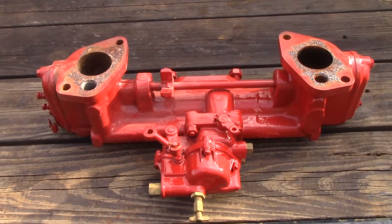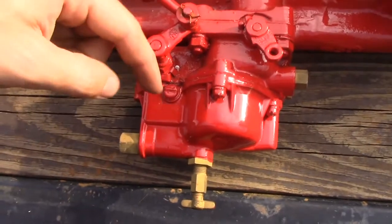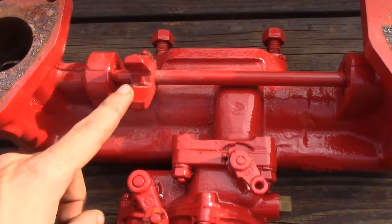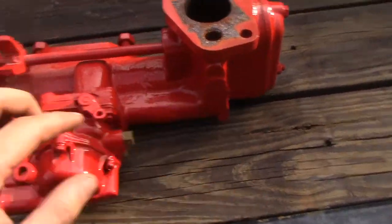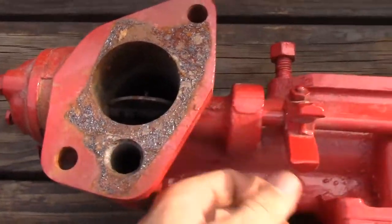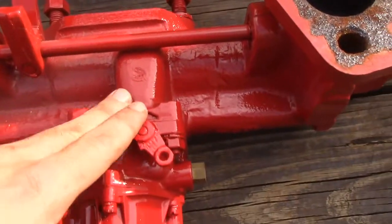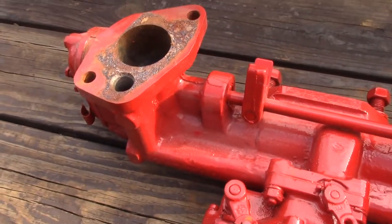Looking at the back side of the intake manifold, you have your little arm here which controls the seat of your needle — the needle seat closes to start and stop the flow of gasoline. You have your choke lever on the back side, and this lever sits in the linkage that goes up and down the side of the engine, which flips back and forth and goes over center. There are springs in the end caps that help it go over center and stay. This also opens and closes your butterfly. Right now it's on the diesel side because the butterfly is open. When kicked to the gas side this butterfly closes, so air goes in down through the carburetor, back up through the passages on the bottom of the manifold, out through the small holes and channels, and into your intake valve.